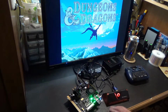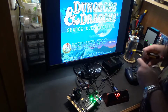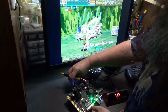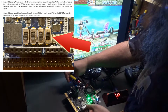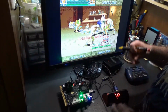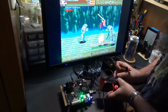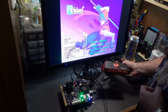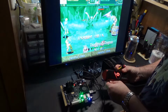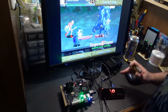The next snag that you're going to encounter, though, is that there's actually no digital audio out anymore, because when you put the DE10 Nano into the MiSTercade, you probably flip this switch here. And what that does is it's going to disable the audio out of HDMI. But luckily, the Avermedia Live Gamer Portable 2 here actually has an analog audio in, and this is supposed to be for recording headset activity and stuff like that off of an Xbox 360 or something, because it's of that era.